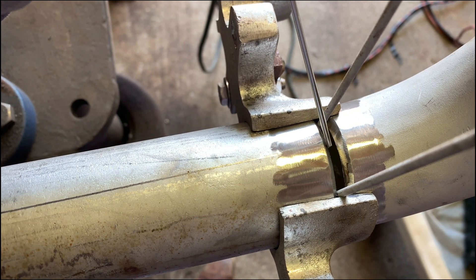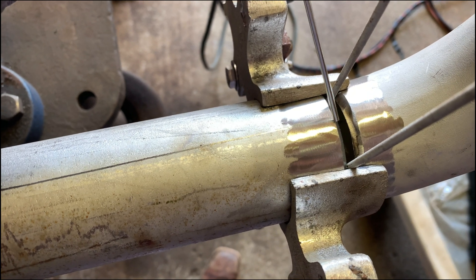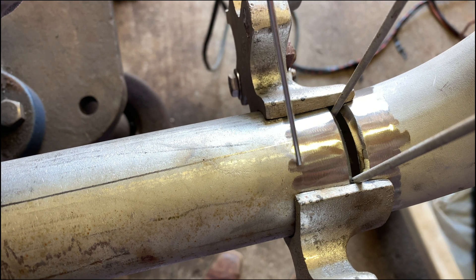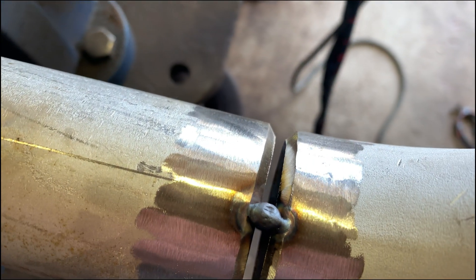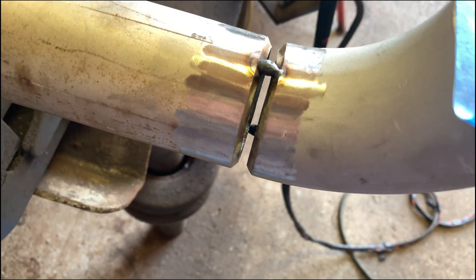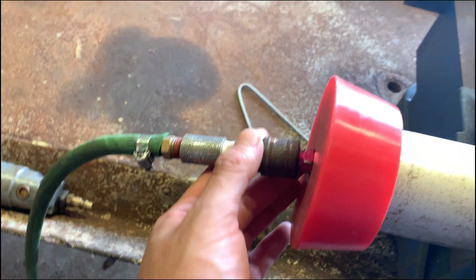The smaller the gap, the hotter I go since I've got a keyhole dip. I try to weld it pretty quick so it doesn't shut. Right now I'm going to be bridge tacking — I don't want to penetrate yet, just bridge tacking. So we've got our bridge tacks in there — a little drippy — and we're going to get started on the weld.